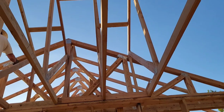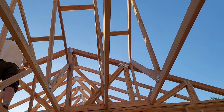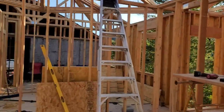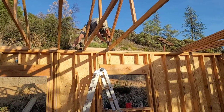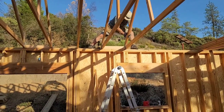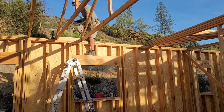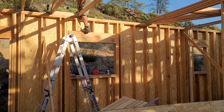You can see they're tying them in on the upper part of the rafter. And then they got the spacers there on the wall that's coming out. So Joe's using a spacer now to make sure that he's got the right spread. When we start sheeting this roof, our plywood's going to be perfect. I got a feeling we're going to end up doing this whole living room. Joe's not letting up, so I'm going to stop filming here. Thank you for watching the video.